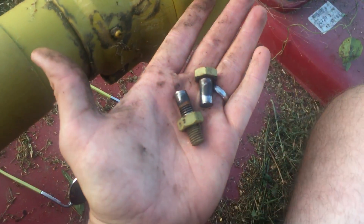That's the same reason an engineer will put a really soft gear tooth on the starter side of a vehicle instead of on the flywheel — because you want the starter gear, which is really small, to break before you want the big flywheel gear teeth to break. Anyway, I'm just chilling out waiting on a ride. Shear pins — smart stuff.